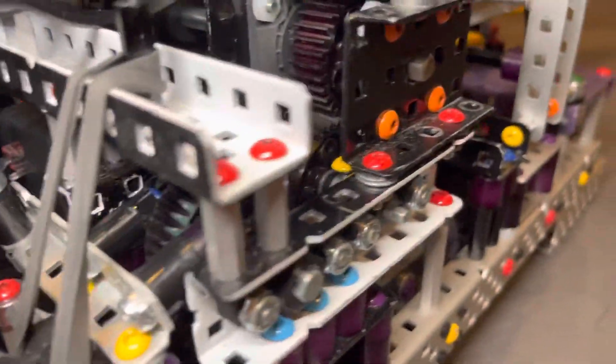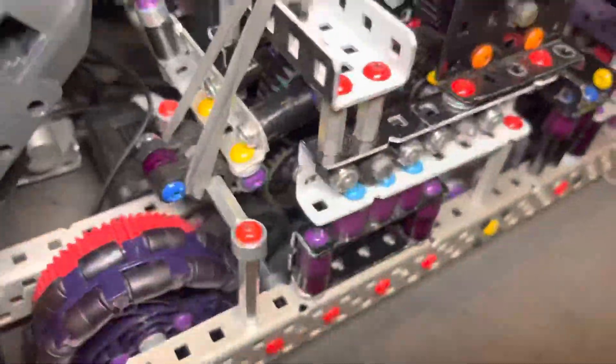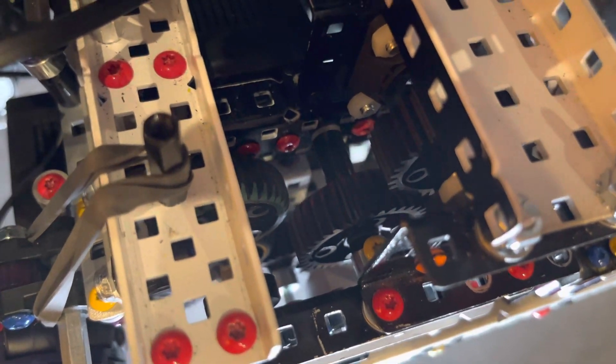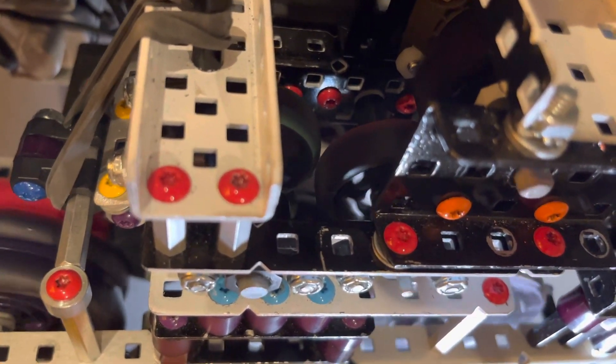When I shift the PTO back — a bit low on air right now — let me just lift up the drive chain so it doesn't move around. When I drive around, you can see these gears are not spinning right now. That's because it's shifted over. When I PTO, this will slide into there and then I run intake — so that's intake — and then PTO again to drive.